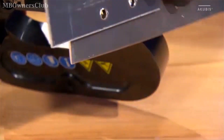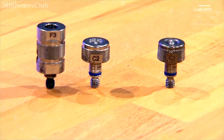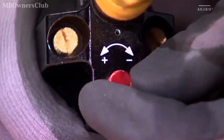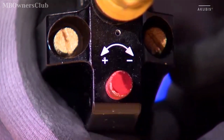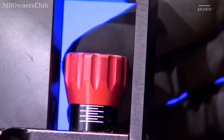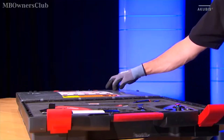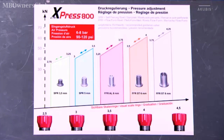To install the Flowform rivet, you'll need the tools F3, C2 and C1. Important: before pressing, set the speed on this button to maximum. The large red button must be adjusted individually depending on the rivet — in our case to level 4. If you want to be on the safe side, also check the pressure regulation on the diagram in the tool case.